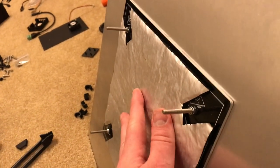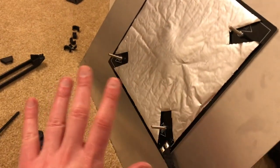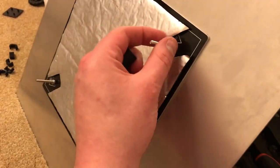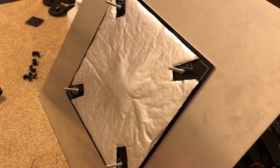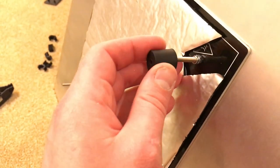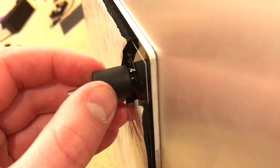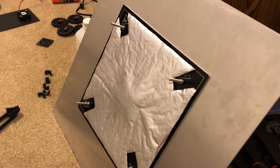The next step in the instructions is to slip on your bed springs. Don't use the stock bed springs - for the love of God, use something at least like silicone spacers, if not a solid aluminum mount. You have this huge bed going on some springs and it's just a recipe for disaster. These cheap Amazon silicone spacers have a little counterbore supposed to slide over a lock nut, but mine may not go all the way down. I may just move to solid spacers since I have an ABL. The less flex we have on this bed, the more reliable the prints will be.